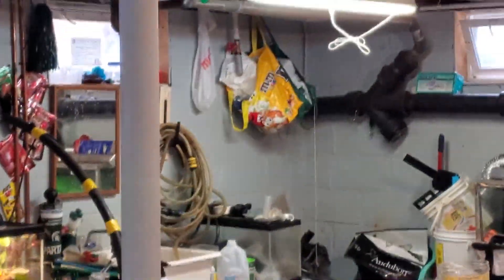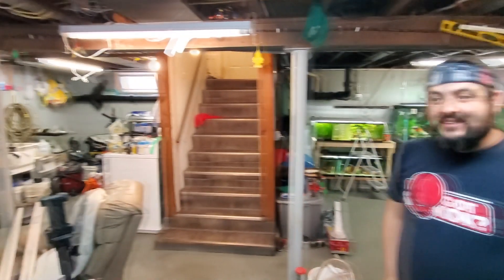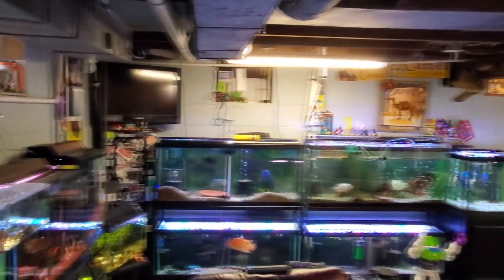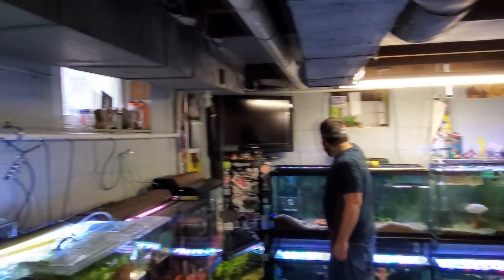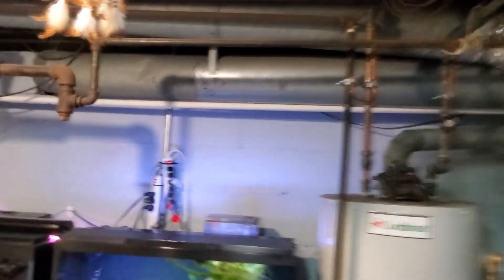All the tanks are running nice. I think we still got quite a bit of air probably coming out of the muffler up there. I just like Anthony very much — he pushes me in this hobby to do better things. One more thing: these are all dry fit. We didn't glue anything here — no primer, no cleaner, no glue — and these fit together super nice. I don't think you'd get away with it with 1-inch, but this is all 3/4-inch PVC, schedule 40. Hope this encourages some of you to put in your own central air system.